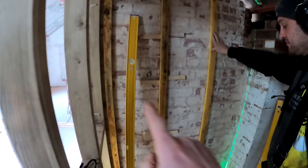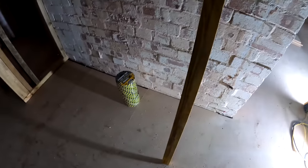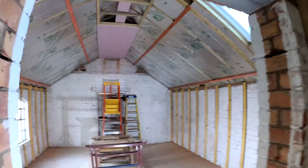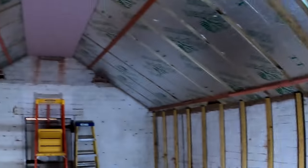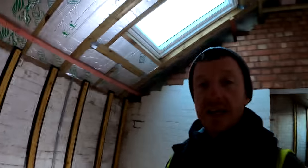Pete is just getting this wall battened. We're going to use elements board in here, across here and across there as well. We've also got a few little bits of insulation to wrap up and then we can start with the tape. We're obviously going to use Pete's special hack with the tape with the little roll thing. There are going to be some bits we're going to have to leave, just to make sure that the sparkies get their relevant cables up, because we don't want to be taping it and then take it down. So we're just going to go through the layout with the clients to make sure they're happy with all the sockets and the lighting, and then we can crack on.